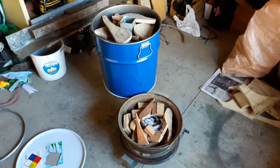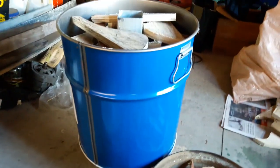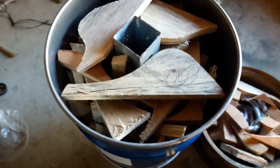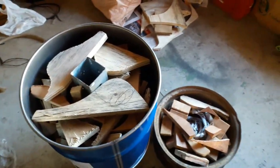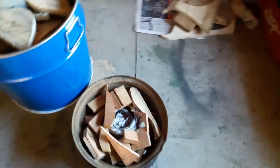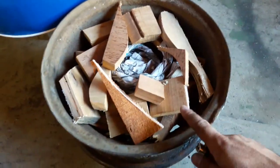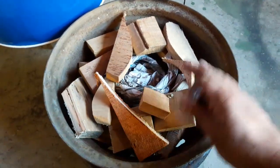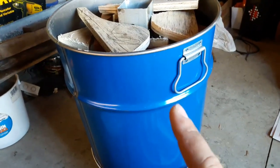This is ready to be fired up. The burner has wood, so that wood will burn and heat the charcoal retort. The barrel has a lot of wood inside. Now I'm going to light up the fire and place the lid back on, then put it on top of the burner. If I need to add more wood to the burner I just drop it through the pipe and it will fall all the way down to the burner, keeping the fire going. I'll need to keep a good heat to make the wood inside the barrel convert into charcoal.